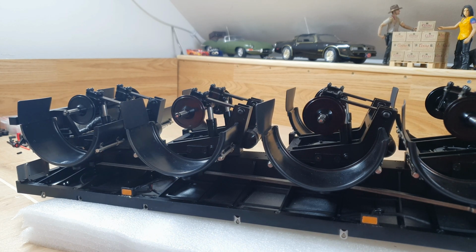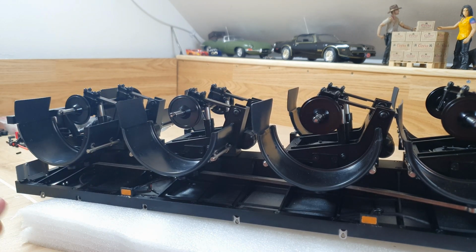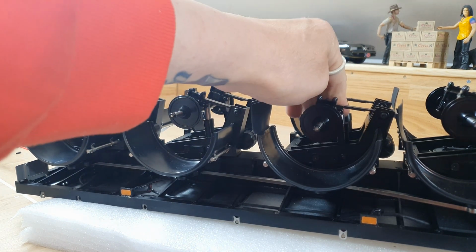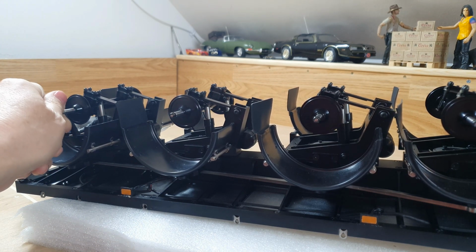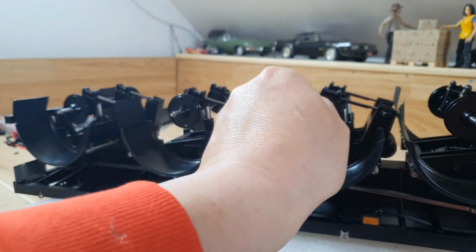That's it. All the shock absorbers are in and they all feel about the same, which they didn't last time. If you remember, they all had these preload spacers and there was a couple missing, which I thought, so that's what made me take them apart. And they are coming right back up to the maximum travel. I don't know how big a job that's going to be to change them, but anyway, I need to take off the wheel nuts because it's time for wheels.